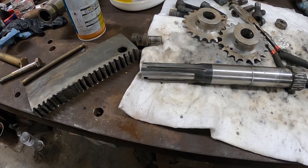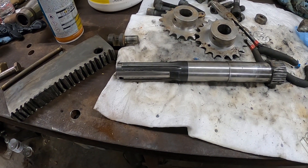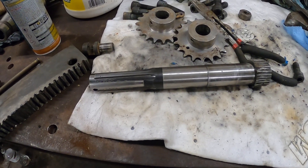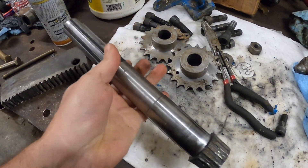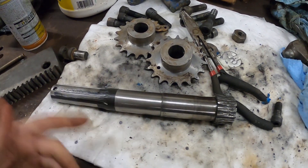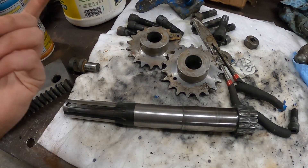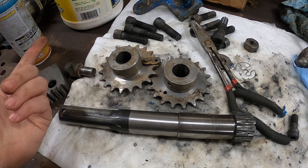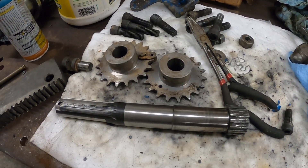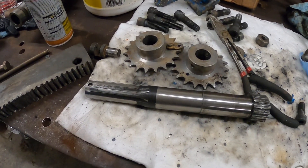This is part one — the teardown. I hope this explains how the head system works on these machines. If anyone else runs into this issue: to get it apart, lift the counterweights out, pull the chain link pins, drive the cross shaft out, and lift one counterweight out.